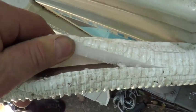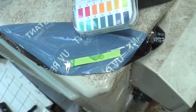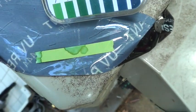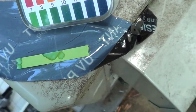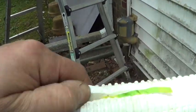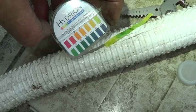I noticed if you open the pipe and you don't see it turning green, it's going to be neutral on the pH. I'm going to show the pH of the line set tape I use — it's made by Berry Plastics — and it's pretty neutral, right about seven. Little spots there. You have to make sure not to touch it because your hands are highly acidic and it puts the acid on there. So the line set tape is neutral. This section came right there and you can see it's very acidic, extremely yellow — a pH of five.